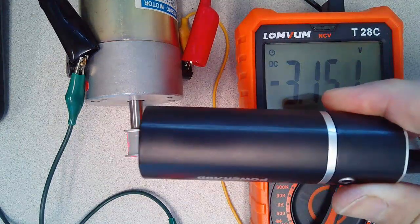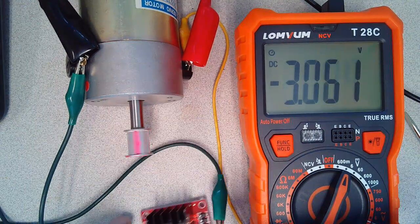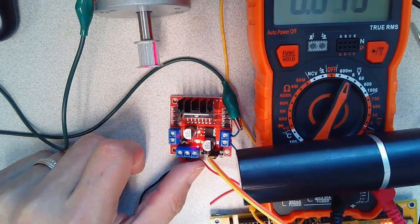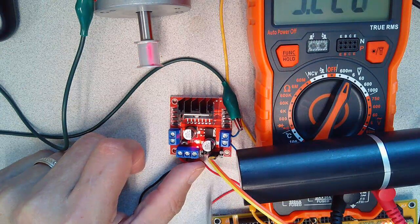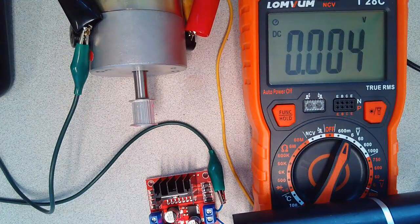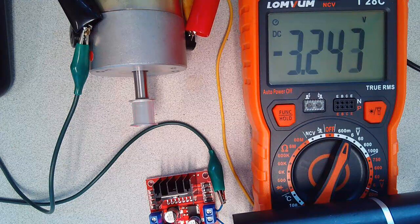In the actual demo I'm using a 5-volt USB battery. I lose about 1.8 volts across the two transistors in the H-bridge, getting roughly ±3.2 volts out. This H-bridge module — used in embedded systems — has two H-bridges on a chip. I'm only using one of them. The voltage drop comes from the Darlington pair drops, confirming these appear to be Darlington pairs inside the package.